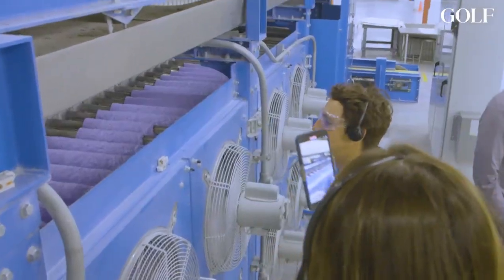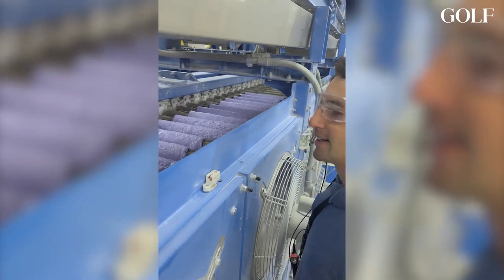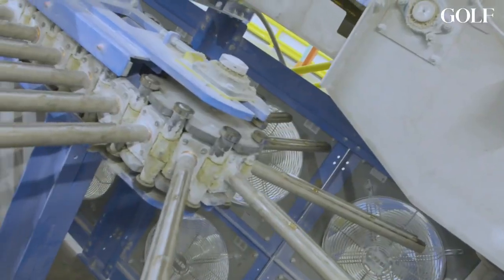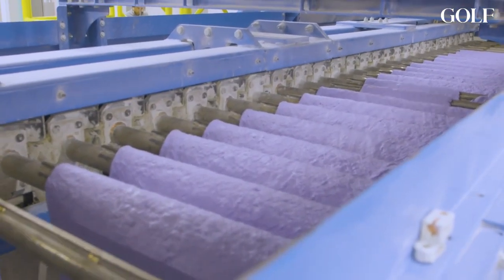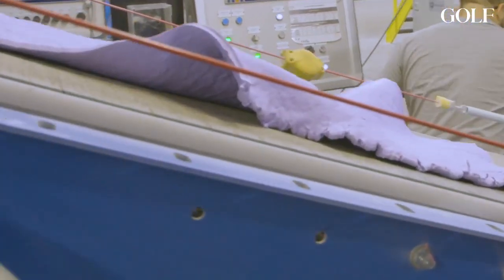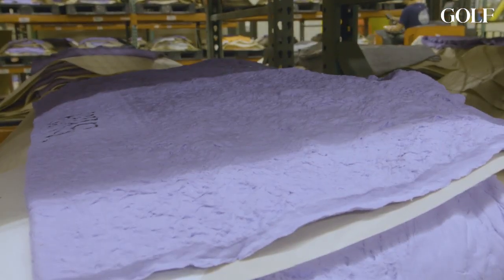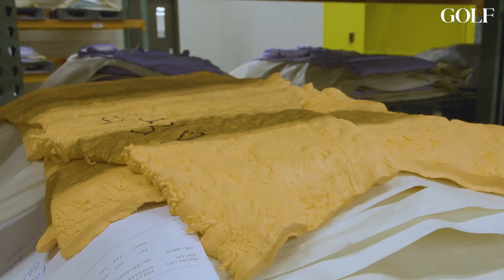The material's been mixed and everything's been incorporated. This step is to cool down the material — we want to take it from the temperature that we mixed it and milled it at down to room temperature. How do you cool something down? Literally a bunch of fans. It is draped on some festoons, on some bars, and it's being cooled down by fans, regulated to make sure we reach the temperature that we want. After the material's been cooled down, it comes down this chute and every single batch gets tested to make sure all the properties are exactly what we want. We then store the batches in our conditioning room, built specifically to environmentally control the area where we're storing the rubber.